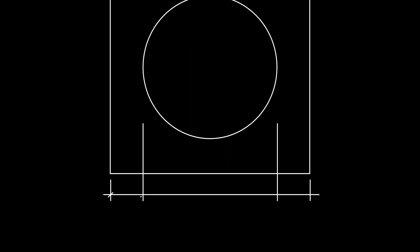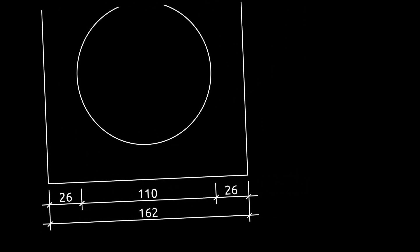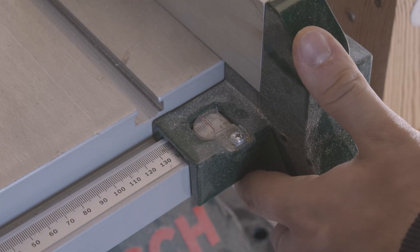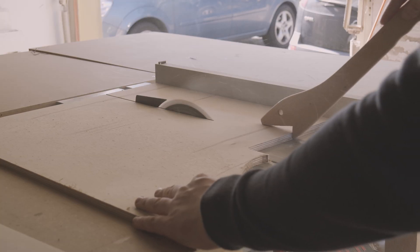Left and right I'll leave 26 mm space, so the total diameter is 162 mm. Because the individual parts are cut out of a plate, I first cut a strip from the plate which has the width of the individual parts, so 162 mm. Then I just slice the strips into pieces and get all pieces with the same width guaranteed, and have less work at the same time.